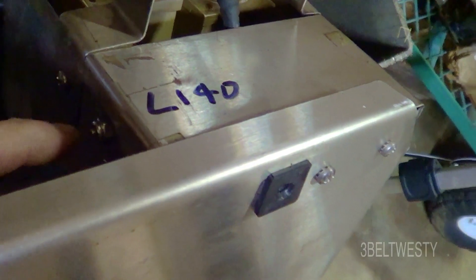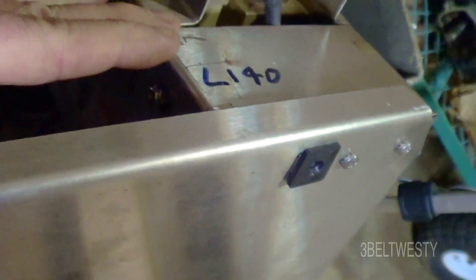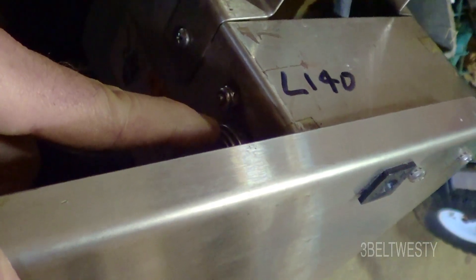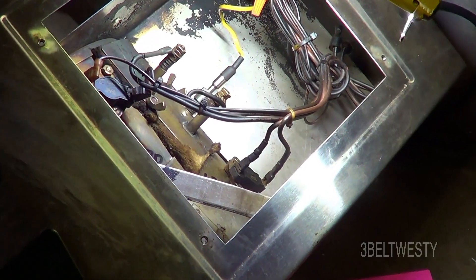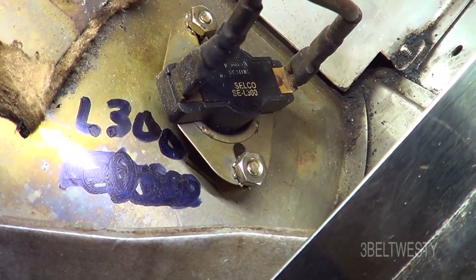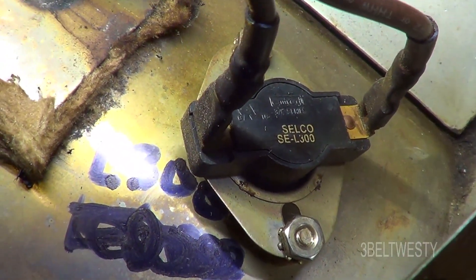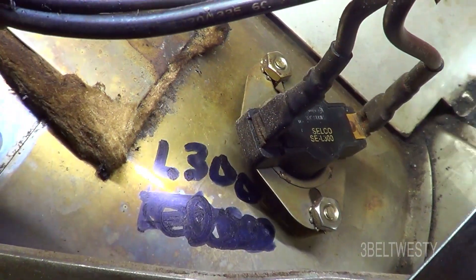These three thermostats on this unit: this is a safety thermostat L140 — if the case with everything covered gets above 140 degrees, it turns off the heater. This is TS, the limit thermostat to prevent overheating, on the lower end of the incinerator.